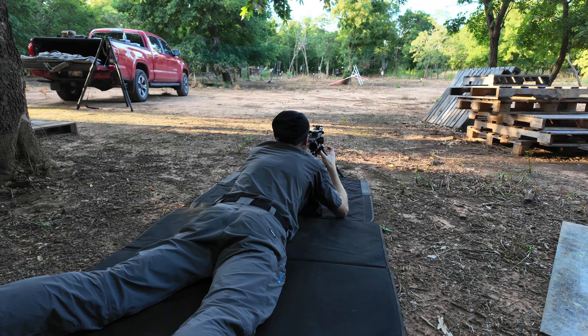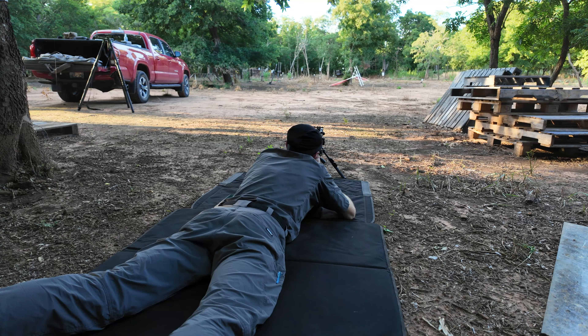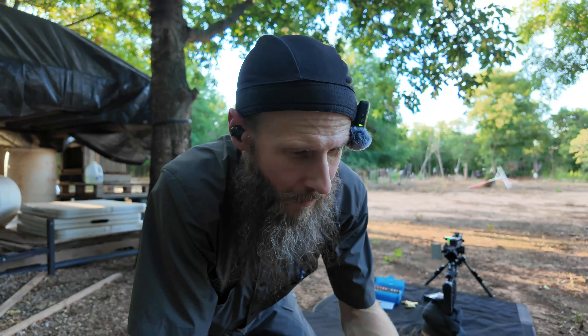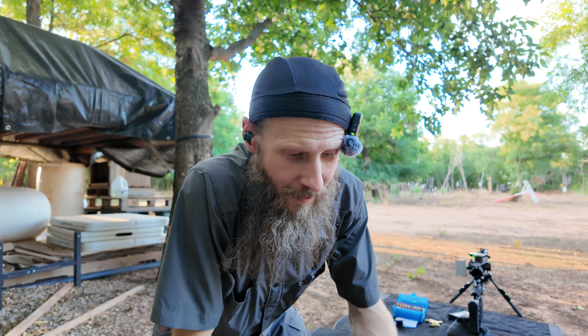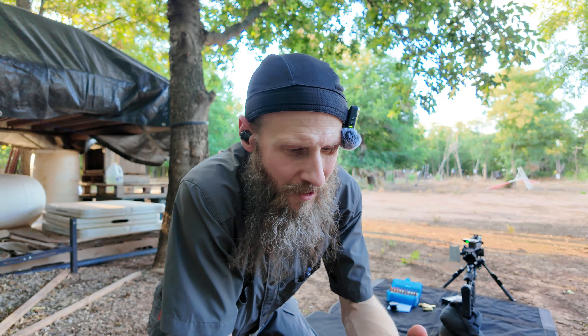Those are boogieing way too fast. I can already tell I've wound up way too much on my powder estimate there. So it's not an every-0.3-grains-gives-you-15-feet-per-second kind of situation. That's what you get with only two data points. Those jumped up quite a bit — my average was 3068, so I jumped up like 140 or so over what I wanted to be. I had a 24 extreme spread and a standard deviation of 8.2. That's just too fast.